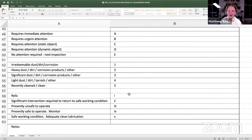However, as I said, you've got a turret clock with a great big weight there and the weight line is fraying. That too needs immediate attention, but on a slightly different level. One thing you'll come across is things like mold, insect infestation. There are some conservators who only deal with insect infestation, and it's an interesting field. And if you see that stuff, you're not expected as a clocks person to be a specialist, but keep your eyes out for it. Again, this is why not rushing straight up to the movement and pressing your nose against the glass is really good. Otherwise, you miss this stuff, you lose objectivity.